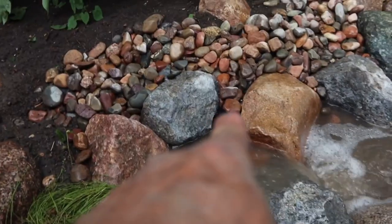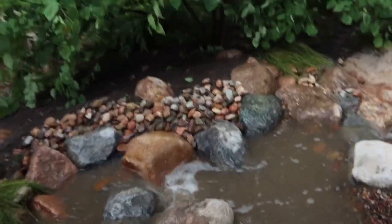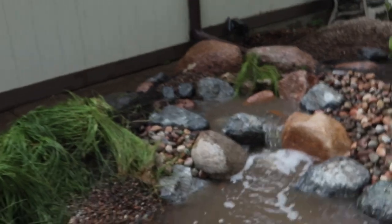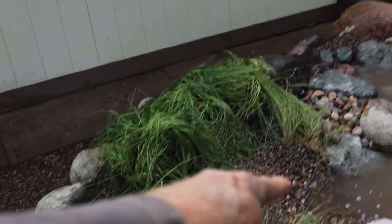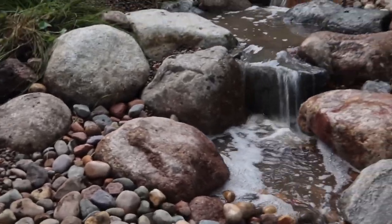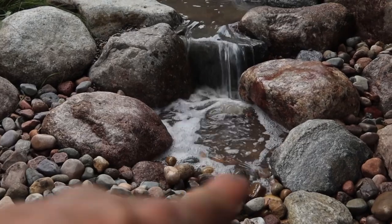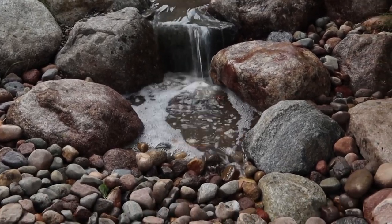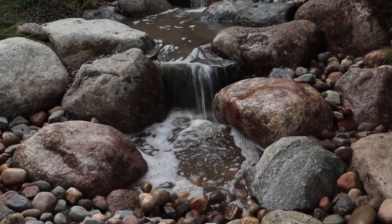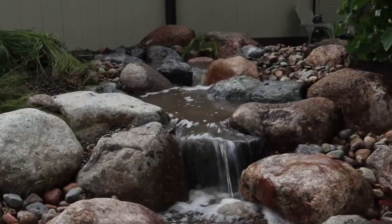Back up in here is where you can see the water bubbling up — that's where our 12-inch spillway is hidden. I love the use of the big and the small gravel: you've got some big gravel up there just to change up the edge treatments, a little bit over there, and then this small gravel edge all through here. We did a bib liner over the top of some of the aqua blocks to give that pooling effect, and then it discharges down right over into here, so that'll be the collection and catchment area for all the debris from the overstory trees. Not bad for 24 total man-hours — it turned out absolutely stunning.